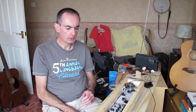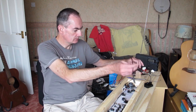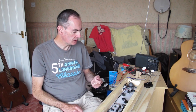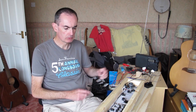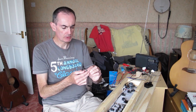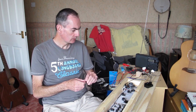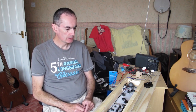The other thing I've done is I've wired in and mounted these USB speakers, which you probably can't see in great detail from there. I've got the original circuit board in there. The speakers are mounted underneath the grills that I've cut in the acrylic front sheet. I've also put a potentiometer on the front side to control the volume — again, that was on the original board. The original potentiometer was this tiny little round thing that stuck out the back of the speakers. I didn't reuse that because there was no easy way to mount it, but thankfully it was connected up by a fairly convenient cable, so I've just soldered that up to a new rotary potentiometer that mounts easily through the panel. And that works fine.